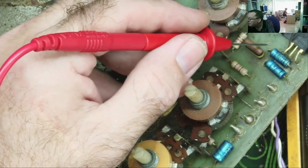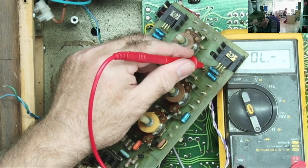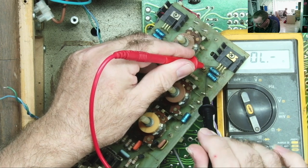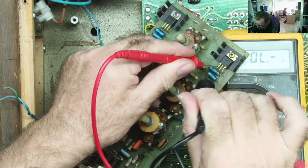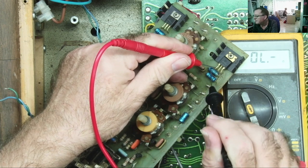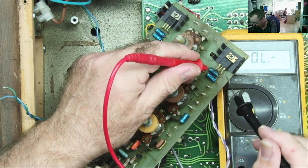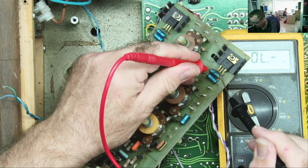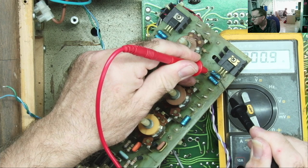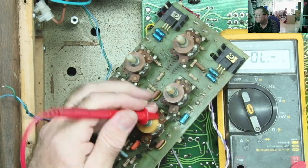So if you go to pin one, and we'll just get where you can see the meter, okay. Go to pin one, then that'll go to the positive ends of both capacitors together. Goes to that one, okay. It should go to this one also, yeah. So those two positive connected together, that's ground. And then one of these will be on the input, which is the 24 volts, and one on the output, which is the 15. That's on the input and the other one's on the output. So those are the two positive going to ground. And then we'll find the other one.